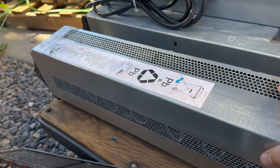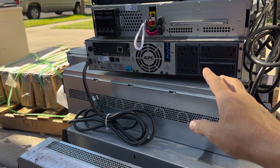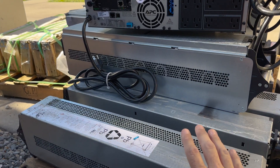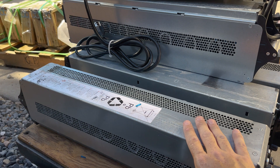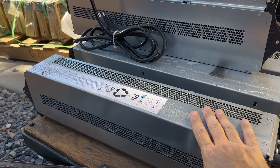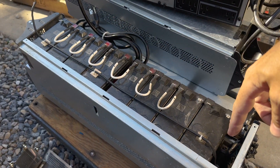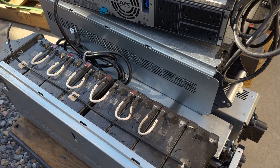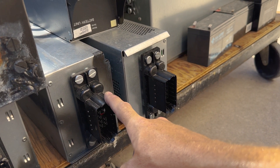These are 50-pound battery sleds or caddies. They go in large APC server rack mount UPS units. Basically, if the power fails, these batteries will run a server or a rack of servers long enough for them to safely shut down, save data, turn off connections — basically prevent data loss. You put a whole series of these sealed lead acid batteries into a series, or you can do parallels and series, and using these terminals here they'll plug into a control unit.